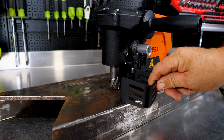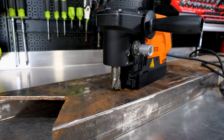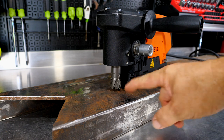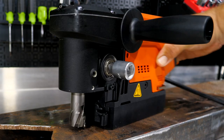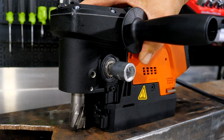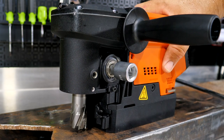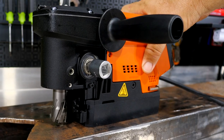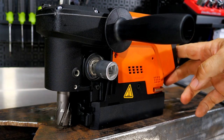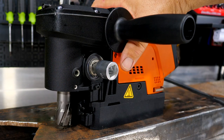By the way, if you want this fence out of the way, you can open it all the way, work it back and forth, and just remove it. We're going to leave it off for this second for the importance of filming, to get a good camera shot. Right now, I can just move the unit all around as I want with just one hand, no problem at all. Now, once I turn the power on — which is basically powering on the magnet — now you see I can move the whole beam around and shake the table based off the power of that magnet. You get either a solid green light or a flashing green light telling you that you're good to go.